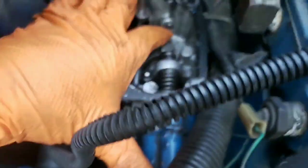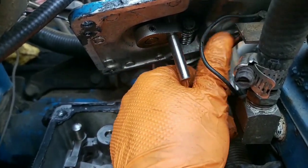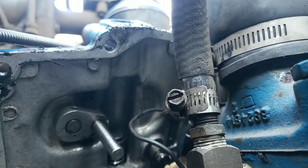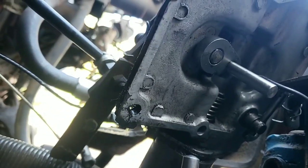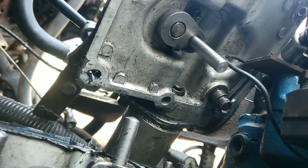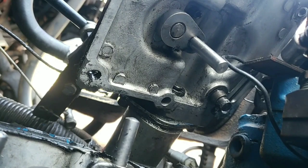We've got our throttle here, moves the plates accordingly, and then we have our fuel shutoff solenoid which acts on this plunger here, and we have our mechanical on/off switch. We're going to be real careful here. I think I can get you guys set up here to watch this - just watch the little spring right there when we key on.